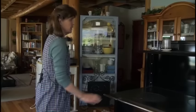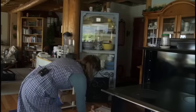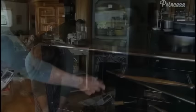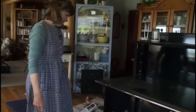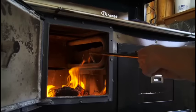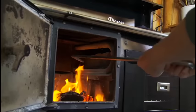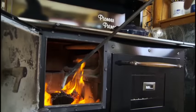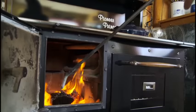You see this little pipe in here — it's U-shaped, and that's what the water goes through and is heated to go up to the hot water heater upstairs. The water goes up by convection, fills the hot water tank, and then we can have a hot shower. This little firebox will heat your whole house — 2,000 square feet — and we have successfully had it do that even below zero temperatures.